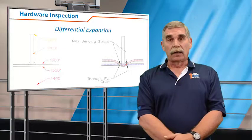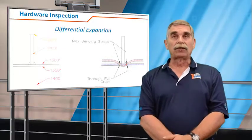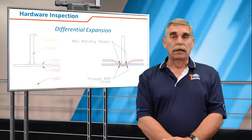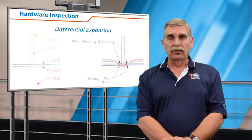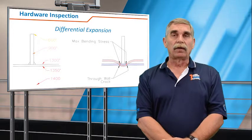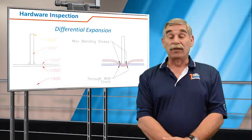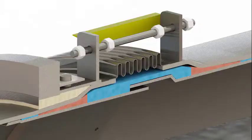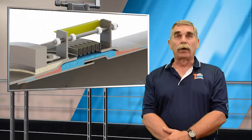There have been some plants that have had limited success attempting to do an in-place deep solution anneal of the fatigued area, and this could prolong the useful life of the equipment for one, maybe two campaigns. As a result of the problem we had with rigidly attached rings to hot wall pipe, Pathway developed the floating ring concept.